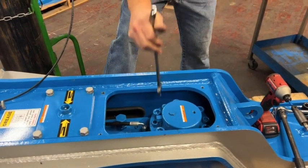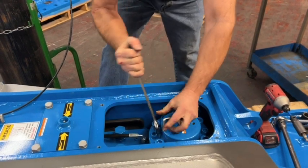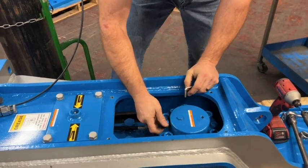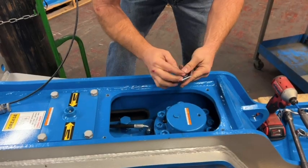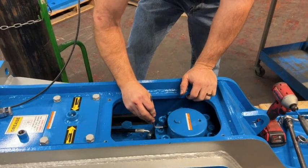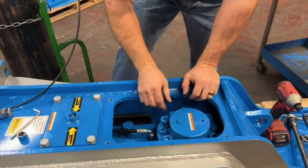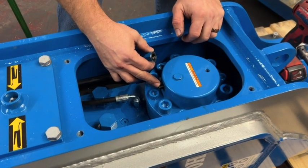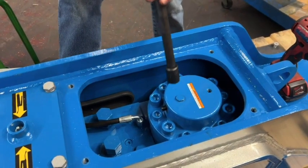So this is my little trick. I like to take the cap off first that controls the gas valve, which is a 22mm. Take the cap off here. Be aware, there is an O-ring right there - if it comes off, you can just put the O-ring back in the cap. If it's missing, you can order a new one or replace it. I like to make sure that this gas valve is snug - you don't have to over-tighten it, just make sure it's shut. Because sometimes when you spin this cap off, it can stick to the cap and open the gas valve a little bit. So when you take the plug off, you're going to be losing nitrogen, which forces you to fill it instead of just being able to check it.